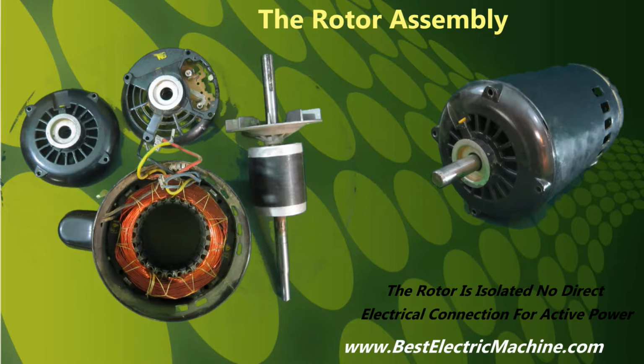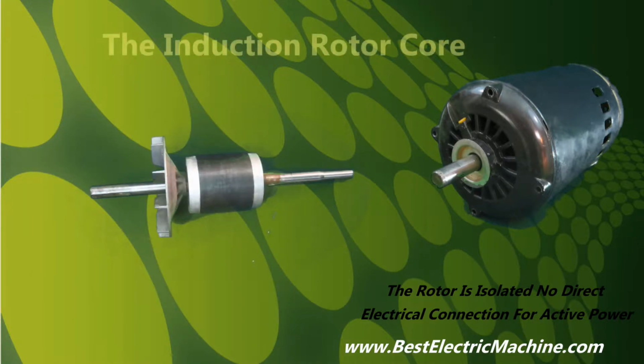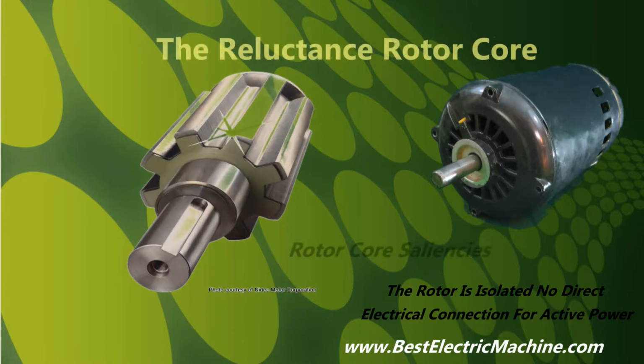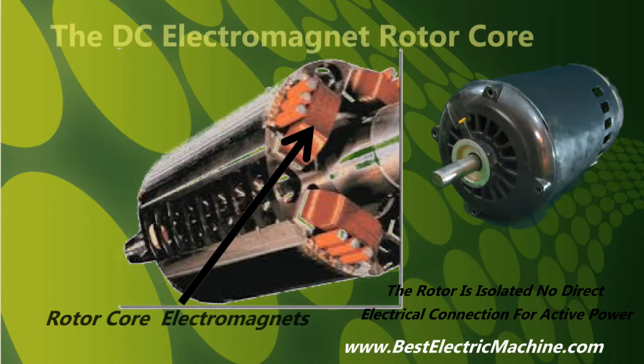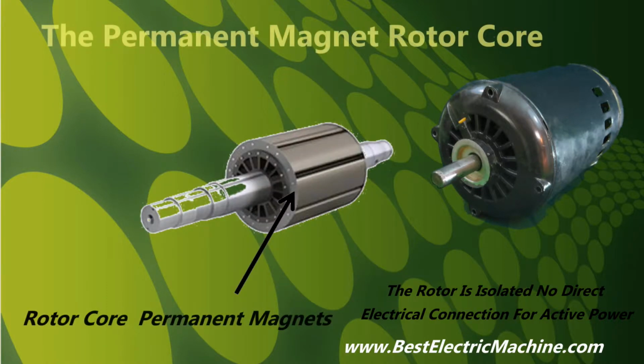Without violating basic motor operating principles, the passive squirrel cage winding is often replaced with other means that also have no direct bidirectional multiphase AC electrical power connection for independently contributing real electrical power to the electromechanical conversion process, such as passive rotor saliencies, for the reluctance electric machine, passive rotor direct current or DC electromagnets, for the DC field wound synchronous electric machine, or passive rotor permanent magnets, that replace the DC electromagnets for the coveted permanent magnet synchronous electric machine.